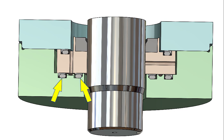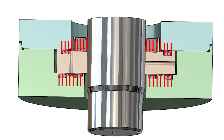The inner and outer balancing seals produce a sealed area on the underside of the backup ring. Lubricant pressure acting over this sealed area produces a hydraulic force acting upward on the backup ring. The upward hydraulic force and the downward hydraulic force are substantially equal.